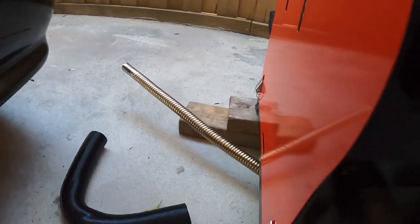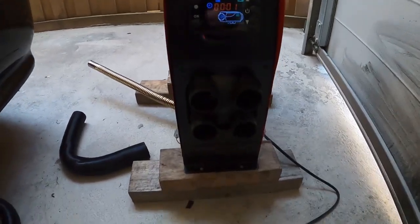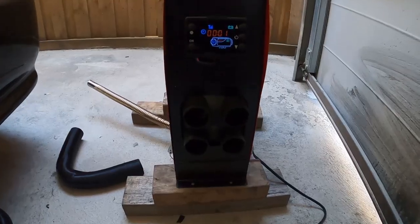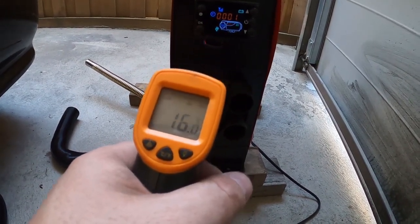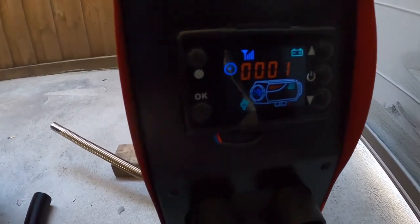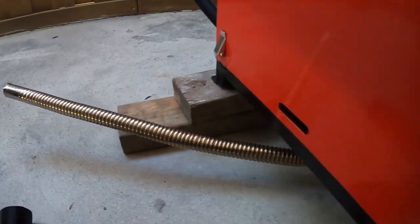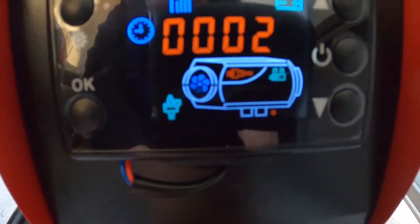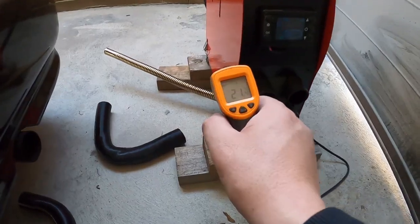Here's how you turn it up. So we're just going to full send it. It goes up to, I think, 5.1 hertz. At the moment it's just warming up the fan. You can see the really cool display there — shows you the glow plugs warming up for the diesel burner, and that's the fuel pump there, and in a second that'll turn on. I've got my exhaust hooked up there and my cold air intake over here. I've just sat it up on some blocks of wood just so I can get the exhaust cranking. Let's just check out what the temperature is now coming out of there — 16 degrees. You can hear the little injectors pumping.